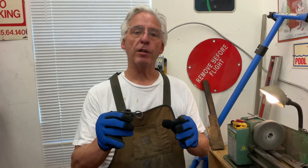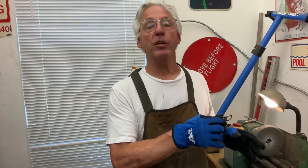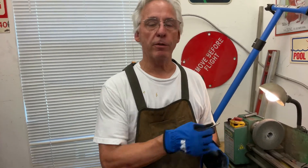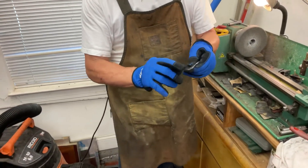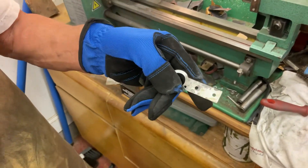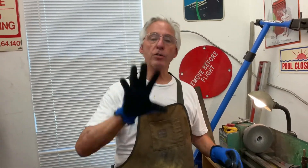Because the finish on your nickel is extremely critical. If you want to do this work before you send it to a nickel plater, it saves you a ton of money. And prep is everything. You don't want to pay your nickel plater to stand there and deburr and do this for you. You can see on this piece here, right across where my finger is, you see all that dark black? That's the nickel coming off. You can't nickel over it because it'll keep eating out. It's like Bondo and rust on a car — the Bondo's going to fall out and the rust is going to keep eating away at it. What you want to do is you want to stop the rust.